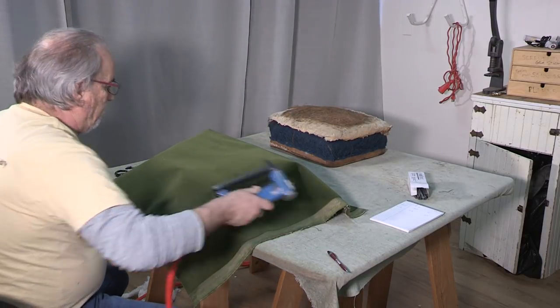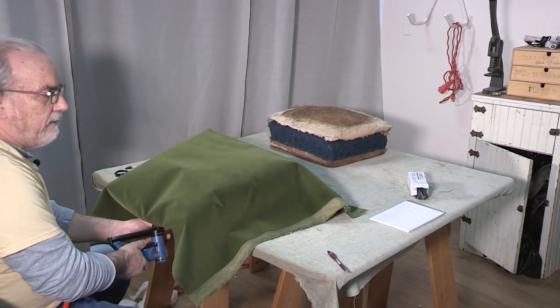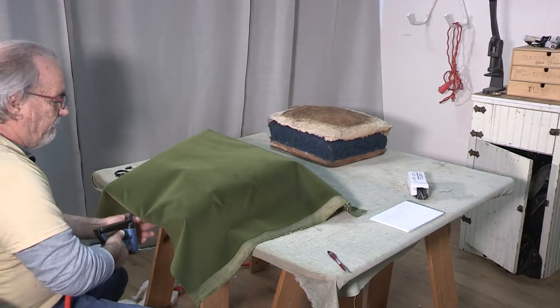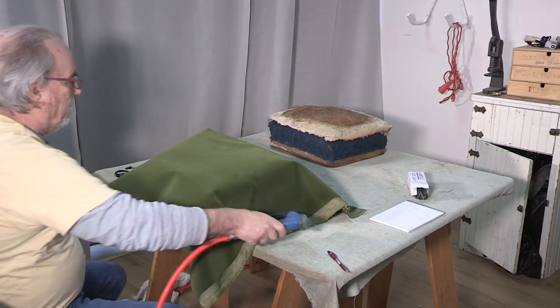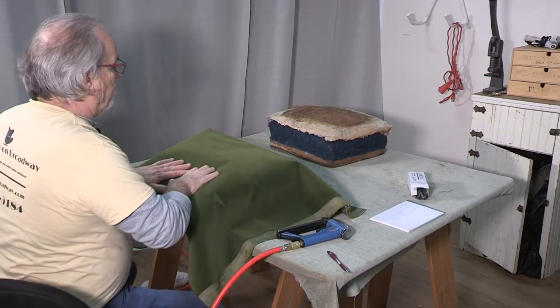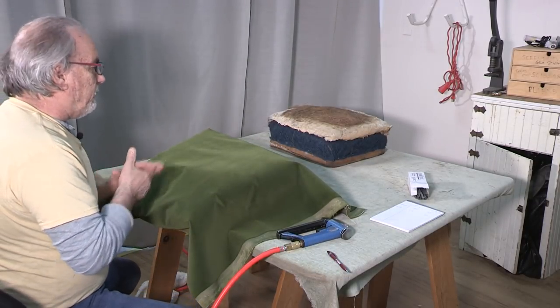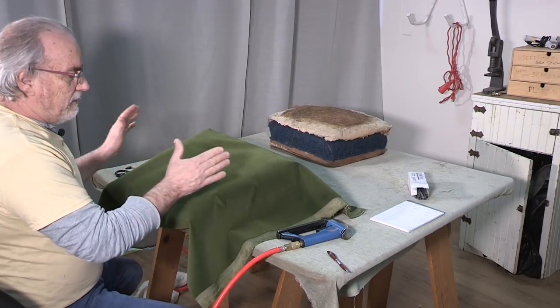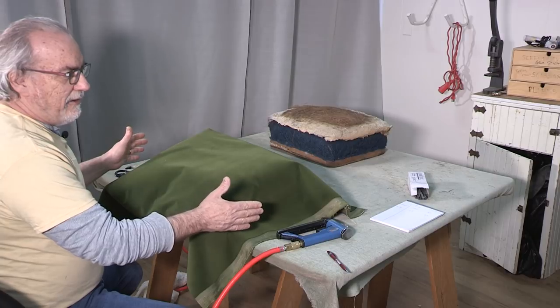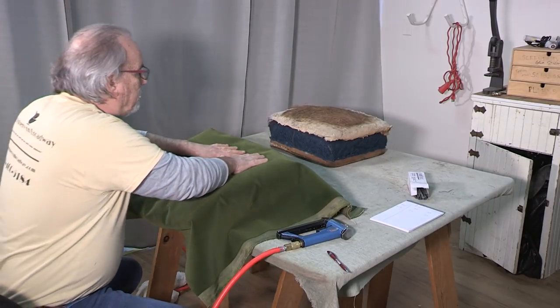Okay, but what I'm going to do first is pin tack the bottom, okay, pin staple, which is I'm not putting the staple all the way in, I'm actually turning it on the side. I'm putting three is all you need really on the bottom. Now on the top, always work from either the top to the bottom or bottom to the top, especially when you have a curve. This is a curve. So I'm not going to consider the sides yet at all. I'm going to make sure that I get this tight first, up and down, top and bottom.